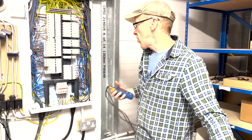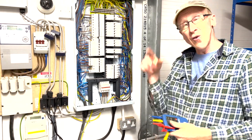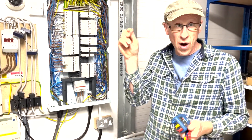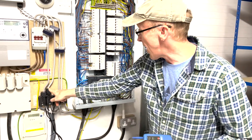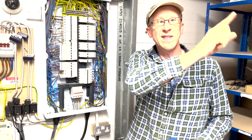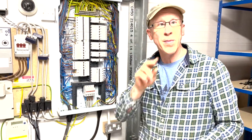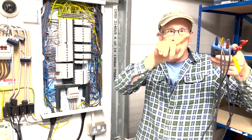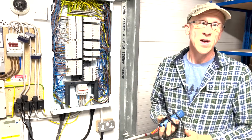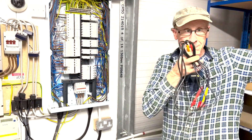We know when I've got these in the right order - one, two, three, A, B, C - this is correct. On our Zappy charger we put it on single-phase charging and looked at the phases on the Zappy charger. We checked it was pulling off phase one, and with our L1 CT clamp we could see it consumed L1, so we know one is connected to one. We can't test two and three directly, but by checking the phase rotation we know one is the start, and as long as it goes clockwise it has to go one, two, three.